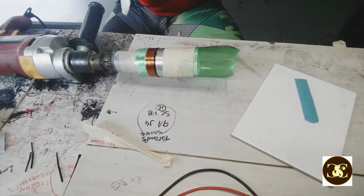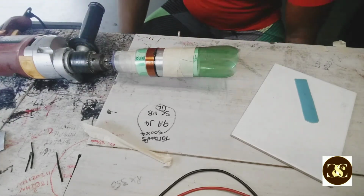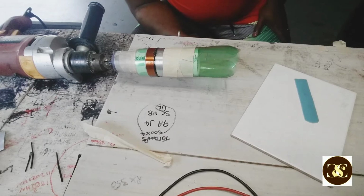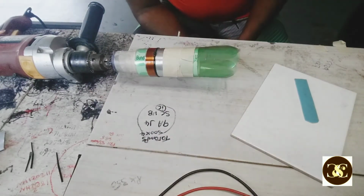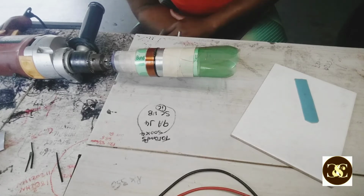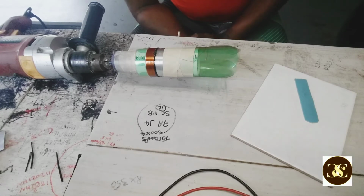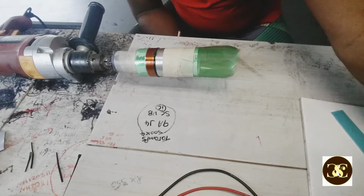So that's how I make my voice coils. Well, not all of them, some is totally different. If I was making a four layer, it wouldn't be this wire. Normally this wire isn't used to make a four layer voice coil. A four layer is mostly for a subwoofer, like bass. When I say subwoofer, some people call other speakers subs, but I'm talking about bass speakers and stuff.